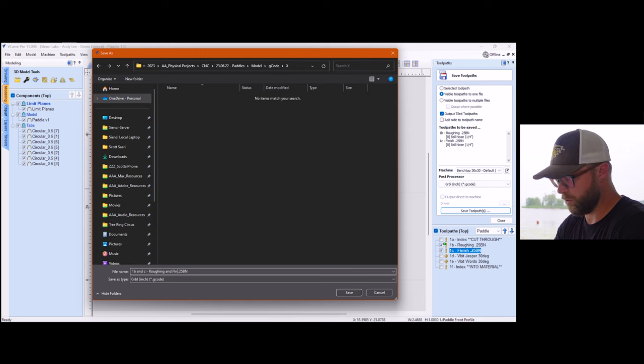This shows you how smart this software is. I'm going to do both Jaspers at the same time. They're both 30-degree V-bits. I'm going to hit save toolpath. I'm going to call it D and E, and I'm going to say Jasper because they're all Jasper. Watch what happens on this one though. Ready? Boom. Tile 2 for Jasper. Because it knows that there's no data in the other side, it only does it on one side. So it still gave you the delineation, but it didn't actually create two different tiles because there's nothing on both tiles. It's that smart. It's genius.